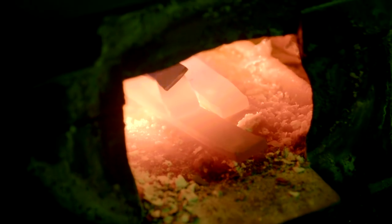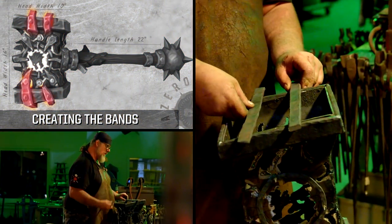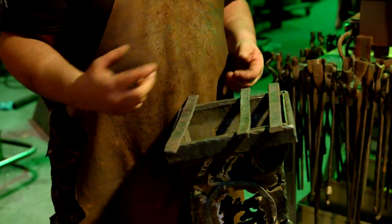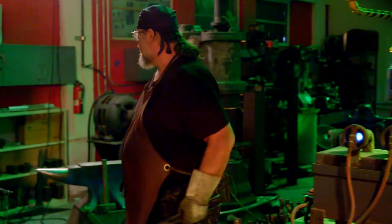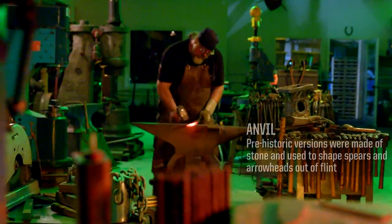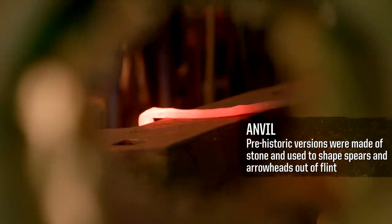When I saw the artwork that Blizzard Entertainment supplied, it showed only two bands. The place you're going to hit with a hammer are these corners, so I'm going to reinforce these corners, adding four bands as opposed to two. I'm just going to soften it at a red heat so I can forge it underneath the power hammer, and then take it to the anvil and bend a 90-degree angle.